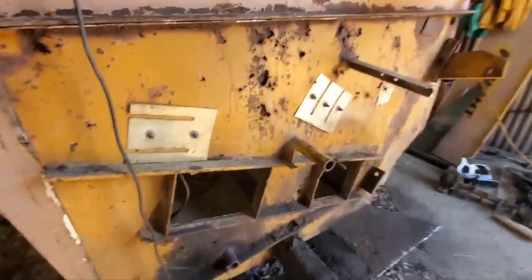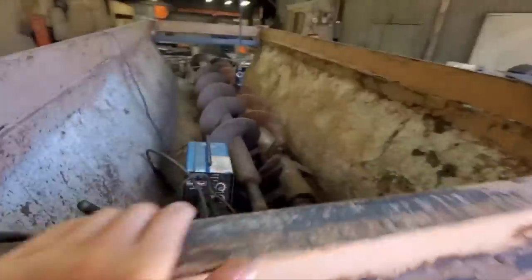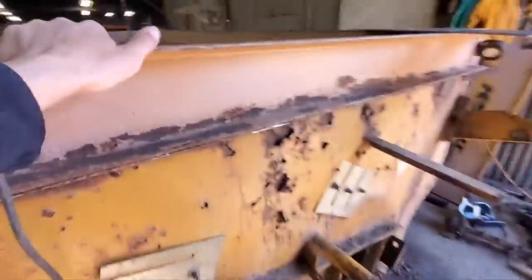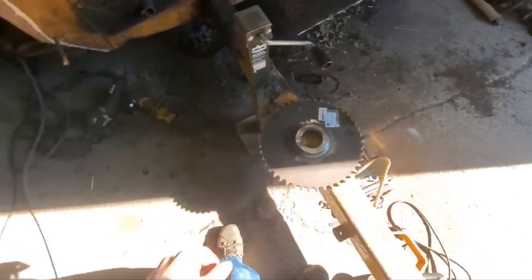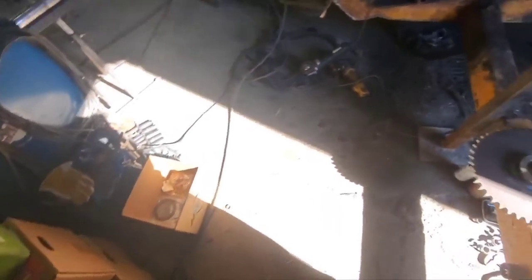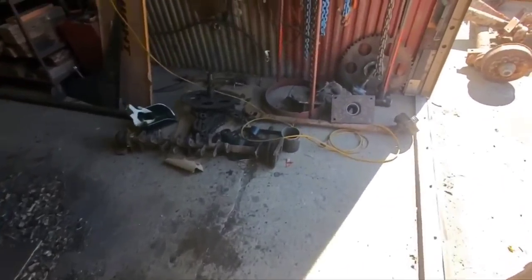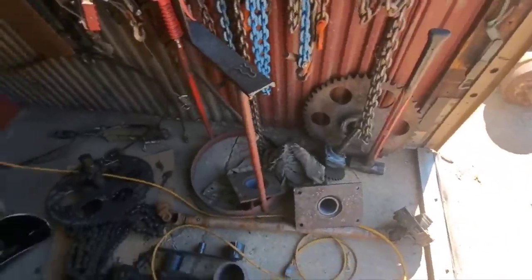Chicken manure will be here in about 2 days. This is where we are at on the spreader. Both templates are made. Just need to be welded back in there and put back together at this point. All new. This one had to get cut off. New hammer kit. Every bushing, bearing, and roller that could be replaced has been replaced and ready to go.